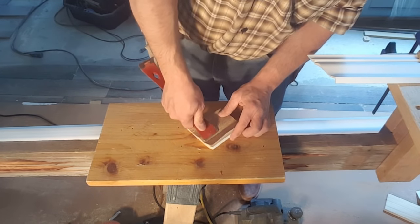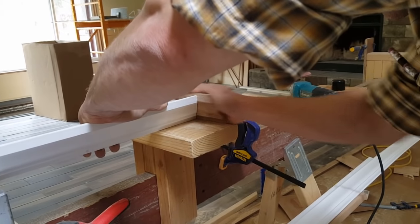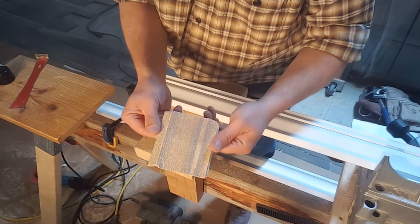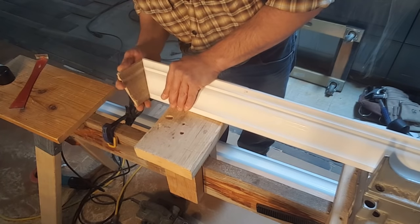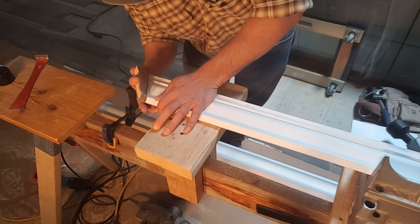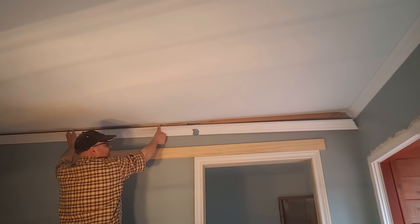The flat bar really helps — take your time, do this right, you'll get good results. I'm sanding it in the upright position like it's going on the wall, that way I have a nice 90-degree corner and I can tell how things are going to fit together. It's difficult to hold those two pieces in the proper position any other way, so I would recommend doing it upright on a block.